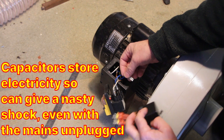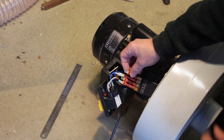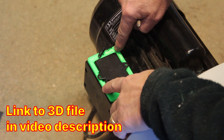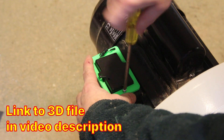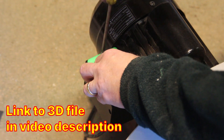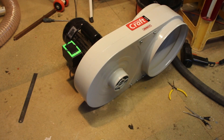I'm ready to wire up now - it's unplugged from the mains but I still have this large capacitor to worry about so I'm going to do this very carefully. This one is from the mains so it should be completely dead. That needs to go to blue in, and that is now completely insulated - I'll just add a little bit of tape around it just to be sure. I've made this little 3D printed interface unit which will allow me to connect the RF board and relay to the original holes. Just because of the positioning of where the antenna wire comes out, I'm leaving it on the outside - probably add a little bit of hot glue just so it doesn't move around. Now we just need a couple of screws, and now the moment of truth. Perfect.